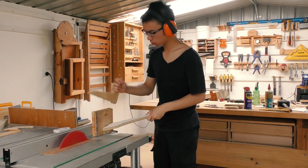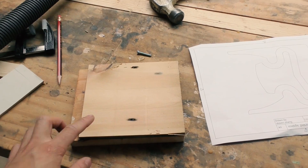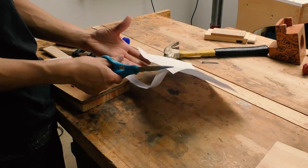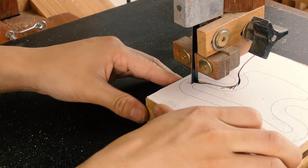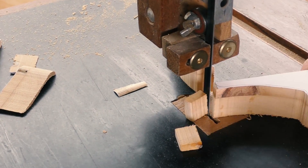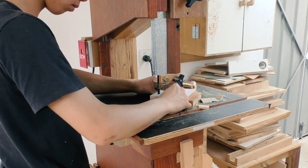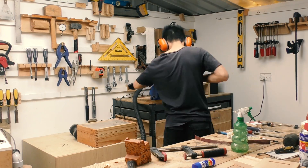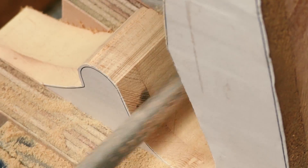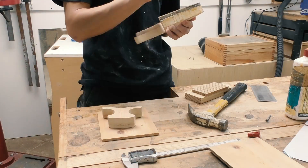By then the glue on the middle piece has dried and I can re-saw it down on the table saw. To cut the shape for the middle section I'm going to use some one-to-one templates. My bandsaw just got a new blade so it was like cutting through butter. Then I can use my belt sander to do as much of the sanding as possible, but some hand sanding is still inevitable. After quite a bit of sanding I'm finally ready to glue this up.